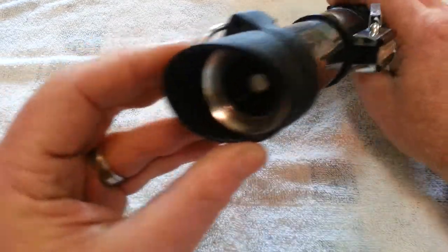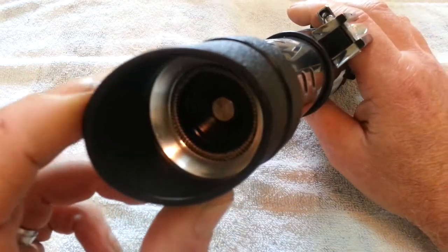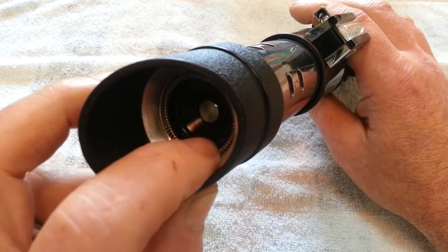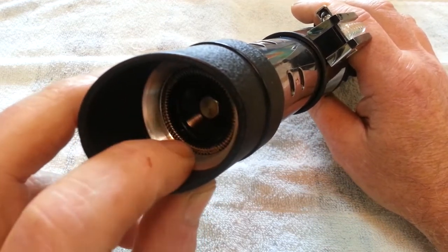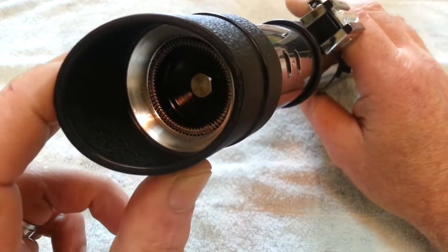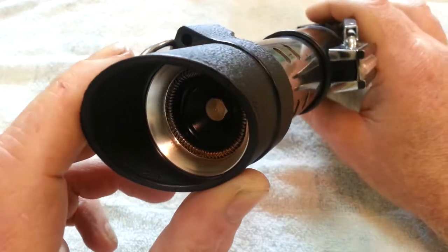So I started out, I wanted to get the spring in here. With this removable blade saber, it had a blanking cap. So I machined that out and cut a groove in here so that I could fit the spring in there to give it that look that it's supposed to have.